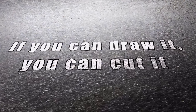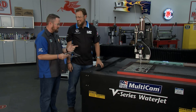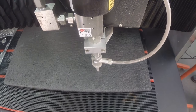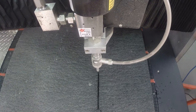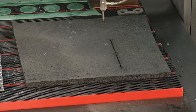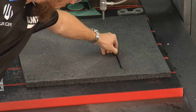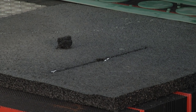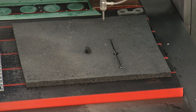So we have aluminum, we have our gasket material, and now the foam. I want to see the foam because that's going to be the craziest thing this thing cuts — the stuff's so sensitive. You told me to grab a wrench — we're cutting a foam wrench insert for a toolbox. That was very quick. A lot of times in your toolbox you want to have a foam insert — well, here you go. That goes right in there. You don't need to use abrasive when cutting foam — it's just water only. You have full control at your workstation whether you want to use abrasive or not. When you're cutting something thick or hard, you use abrasive; when cutting foam, water only.